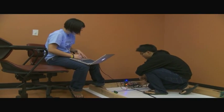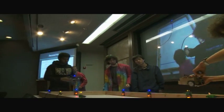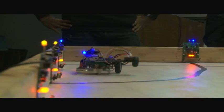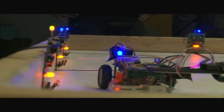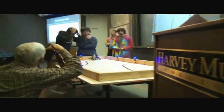They took all the information they had to program the robot to run for the final challenge, which was a capture the flag style game. We started out with four beacons claimed for one team and four beacons for the other team. The audience knew which team they belonged to because of colored LEDs, but the robots were looking at something called gold codes, which are used for GPS positioning. The robot could read the signal and then use techniques to process it — figure out whether the beacon was claimed for their team or not, and if it was the other team's, go claim it.